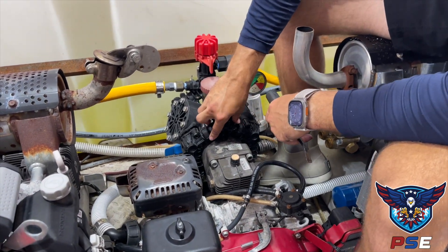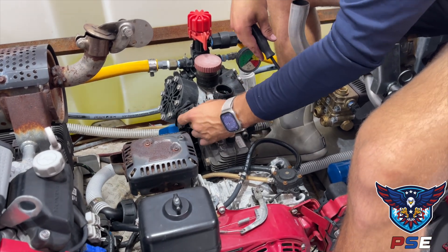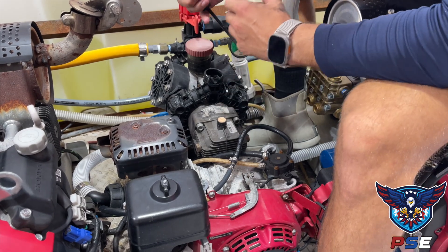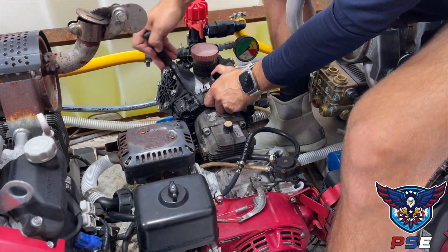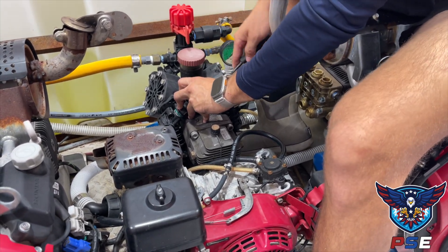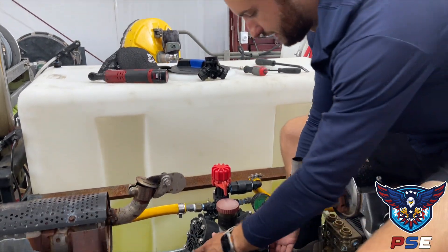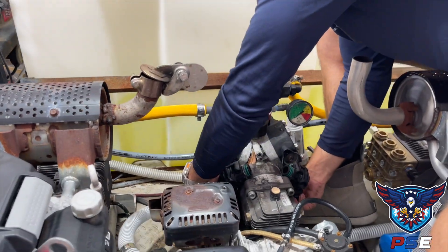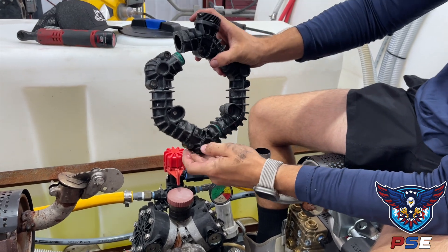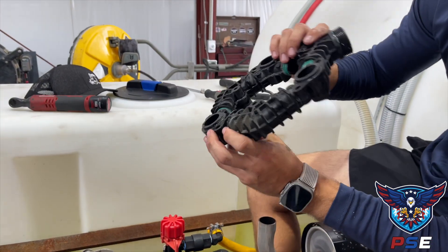Now that you have the bolts out, you're going to pull the manifold off — it's just a matter of grabbing it and lightly pulling it. Depending on how old your machine is, it can be tough to get some of these o-rings out. These are individual pieces on each of the three check valve holders. If you can't pull it with your hands, take a pry bar and lightly pry it on that side, and then this groove here — just to give it some persuasion. Now that that's off, set it down so you know which way it's oriented, and then this part will be easier to get off. You can inspect it to make sure your o-rings are still good and don't need replacing.